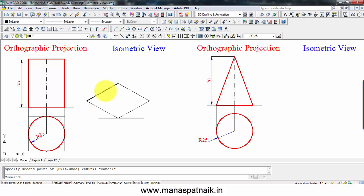Now we'll be preparing the isometric view of this circle. If this is a rhombus, we can see that this represents the larger diagonal and this represents the smaller diagonal. What I'm going to do is take each corner and join it with the midpoint of the opposite two edges. From this corner we'll produce two lines intersecting at those midpoints. That's it — there you go.